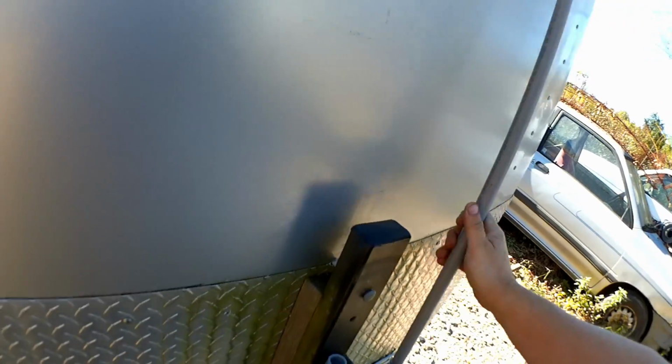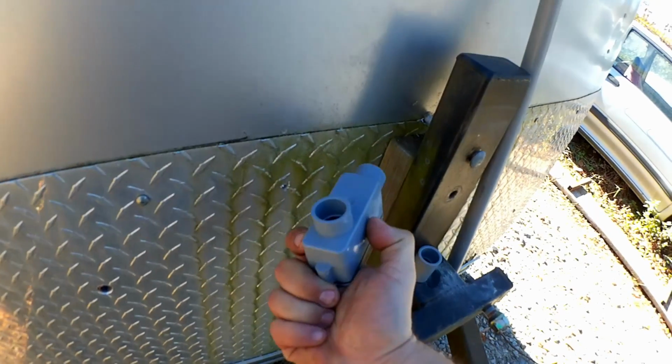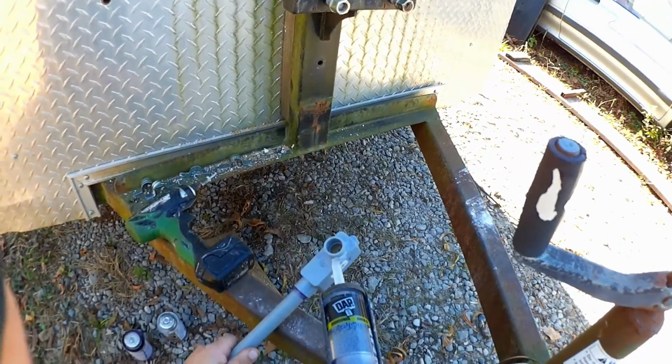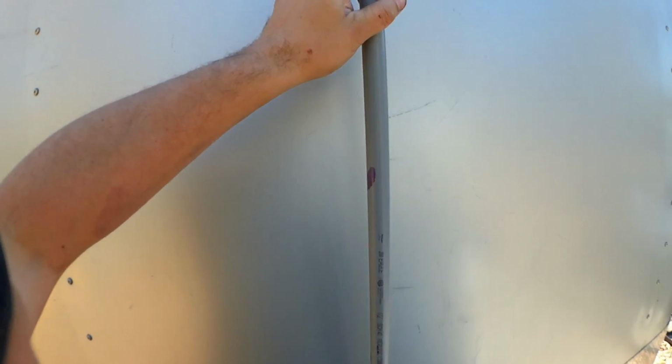So I'm going to put the wires from the roof on the panels in some nice PVC conduit here. Otherwise, in this case, they'd be literally flapping around in the breeze. So I got a drill for this fitting, which is an inch and an eighth roughly. Just put some sealant on there. The sealant is thick this morning, and I've marked where there's a piece of frame in there. The hollow side is facing this way, but it's wood-filled on this front.